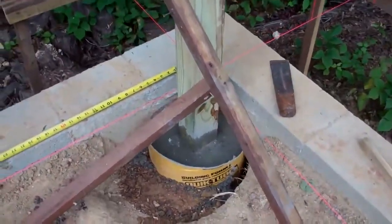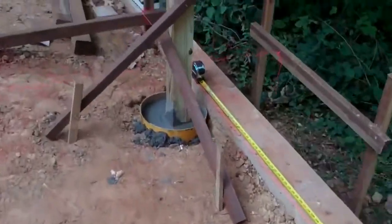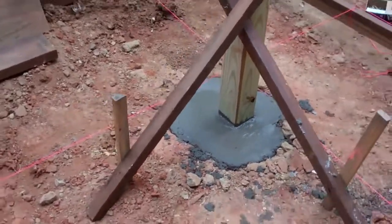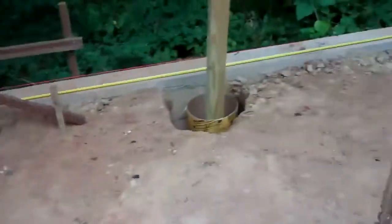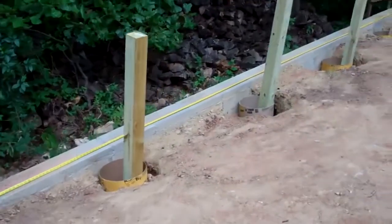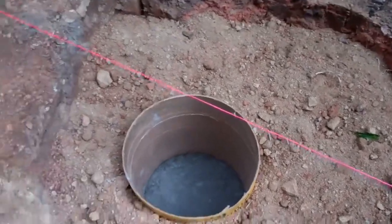We've got the four corners encased in concrete, all squared up. These are next — along the wall — and this is towards the front, and this is the other corner. Only an eighth of an inch out of square, which is really not bad for a mega shed. We'll continue doing the outer wall, get those encased in concrete, because trying to beat the weather — if it starts to rain it's going to mess up these tubes and cause them to cave in. We had a little concrete left over, so we went ahead and put a footing in the bottom where the stump was, so the rest of the stump is buried.